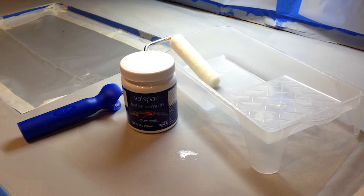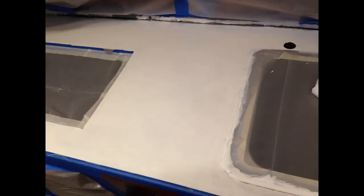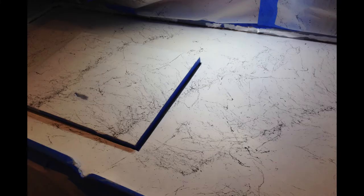After your bonding coat dries, for this particular type of countertop that I'm trying to replicate — which is a white marble with a black graining — you want to apply your base coat. I went to the big box store and got a standard white paint and primer together in one, which you see here. Since I didn't have a large area, I just picked up two small sample sizes. With the first coat dry, I went ahead and applied a second coat. Stone Coat Countertop says you only have to put one coat, but my particular situation required two. Now in order to get the veining, I used a product called Montana Marble. It comes in a spray can — you essentially just hold it up in the air and spray over your countertops in the direction you want the veining to go. With the openings placed back in, I used the Montana Marble to spray the veining. Here you see what it looks like.